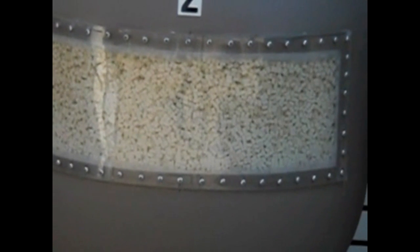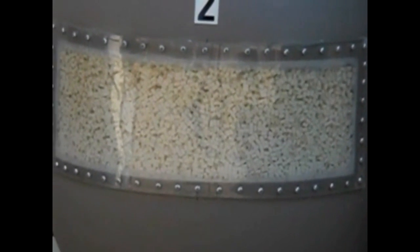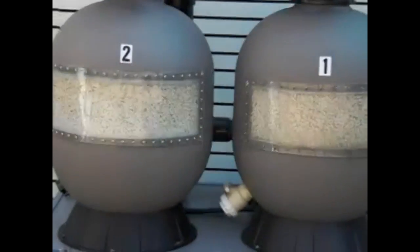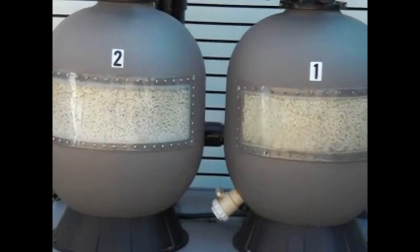The reason is that the media has risen to the top of the filter, clogging the exit, reducing the water flow through the filter. Therefore, dirt trapped in the media will not be expelled from the system, rendering the backwashing of your filter totally ineffective.